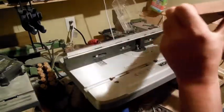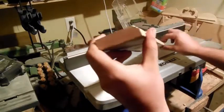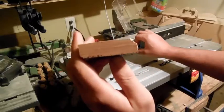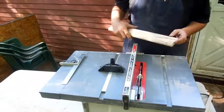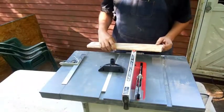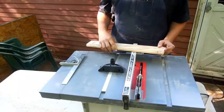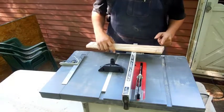We're not done, but let's see how that looks. A cove and bead is what I should have said, not a cove and roundover. I don't know if my camera is going to pick up that profile edge or not. So I've set up my table saw. I've gone with an inch and a quarter, which is a full inch thick on my piece, and then I added an extra quarter of an inch because I'm going to put a little quarter-inch dado slot in here for my runners to fit into.